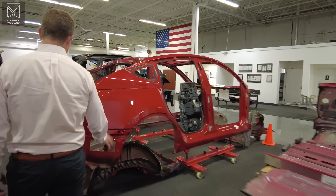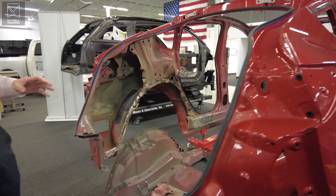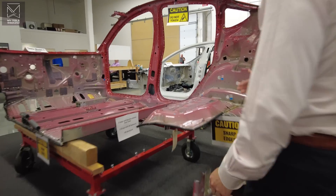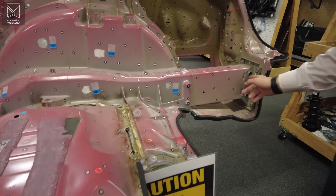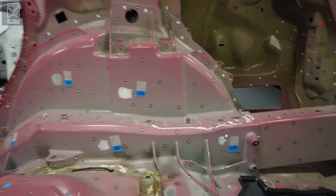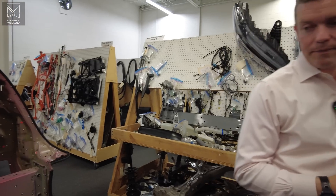We're talking about the Plaid, but we also have the same report for the Model Y from 2020 and the Model Y from 2022. You see a huge reduction in the number of fasteners from vehicle to vehicle, which means it gets easier and easier to build. Look at the size of this front casting and rear casting — what that's doing is eliminating all these joining procedures, whether using SPRs, self-piercing rivets, structural adhesive, or fasteners. When you make the part larger and larger, you're eliminating all these opportunities for error.